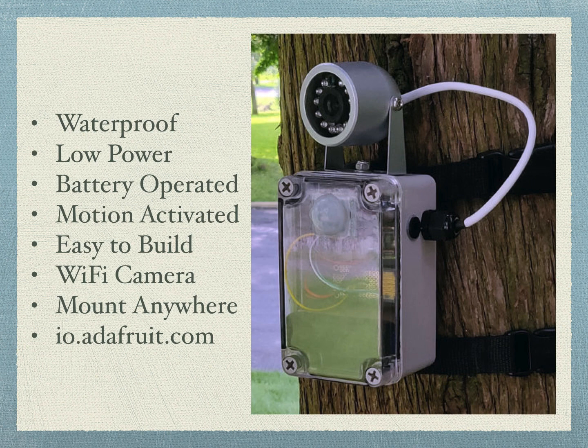This is the MammalCam. The parts come from Adafruit.com and your local hardware store. The waterproof IR camera on top is connected to the waterproof box below using a cable gland — the big black thing on the end of the cable. The gland grips the cable and the box tightly so that water can't get in. In front of the cable gland you can see the DC jack, which is where power enters to recharge the battery. The white dome below the camera is the passive infrared motion sensor, or PIR. It's used to wake up the sleeping feather when it's time to take a picture.